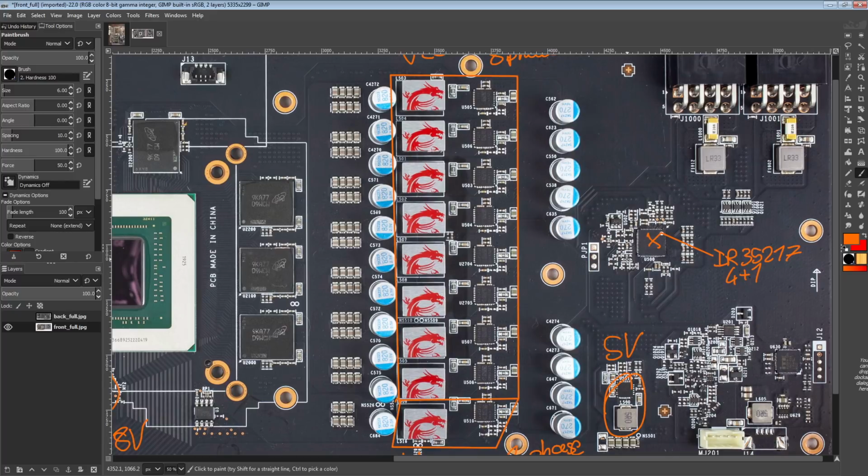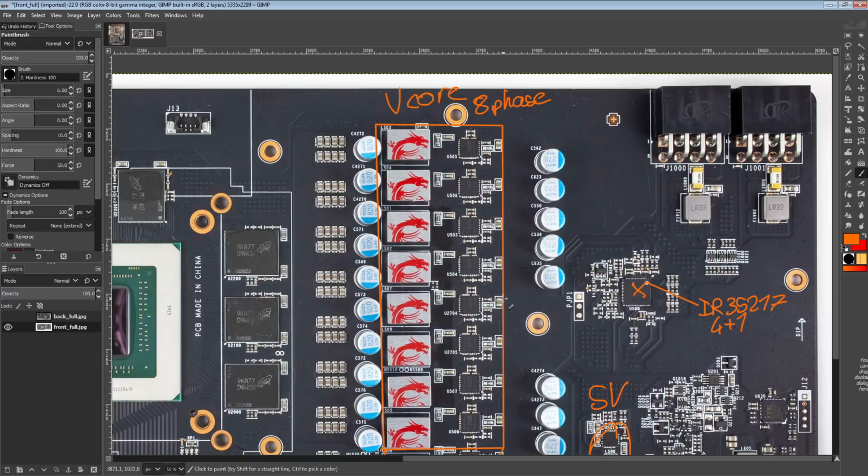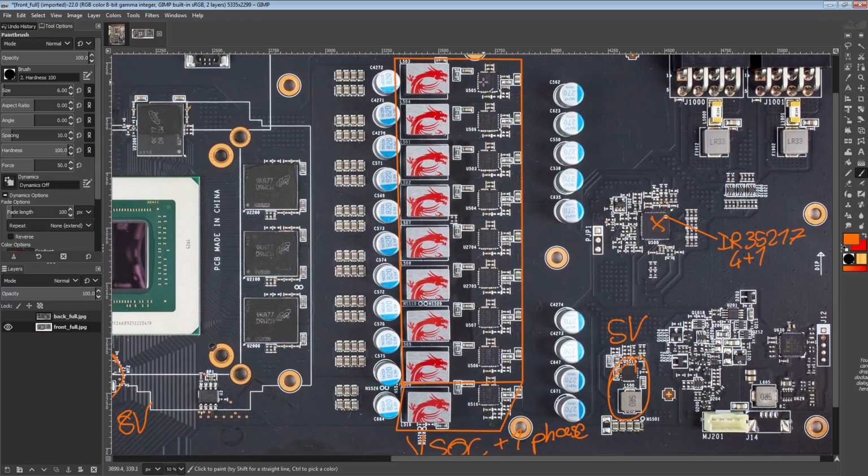There's basically then the actual firmware of the controller itself, which will affect the transient response. So there's too many variables in the transient response performance to really say, hey, if the card has doublers, the performance is going to be terrible, because there's too many other things that could completely negate any impact the doublers had and get the card onto the same performance levels as other cards without doublers. Not that there's that many of those. Actually, there's quite a few of those for RX 5700 XTs. There's also quite a few cards with doublers, so that's worth keeping in mind.